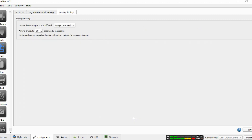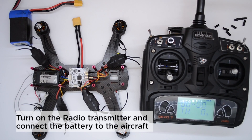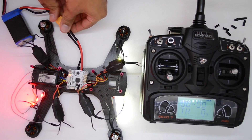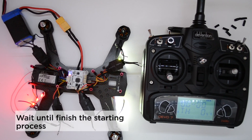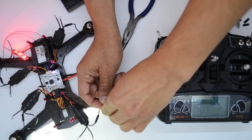After we do this, click next, then we are going to select how to arm the motors. I am going to arm it using the control command — yaw right — and assign a time of 10 seconds. Now that we have done this quick calibration, turn on the radio transmitter and connect the battery to the flight controller. Wait until the flight controller boots, and please do not move it at all while it is doing this. Now we need to check the spinning direction of the motors.